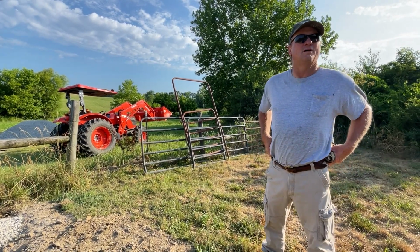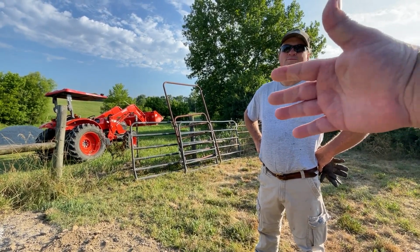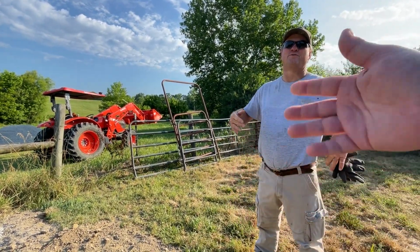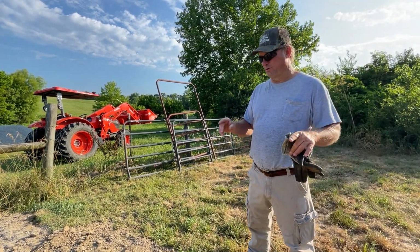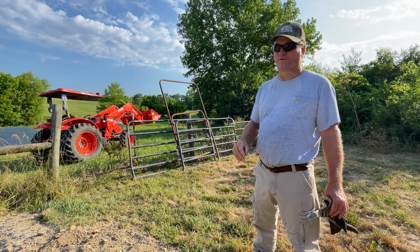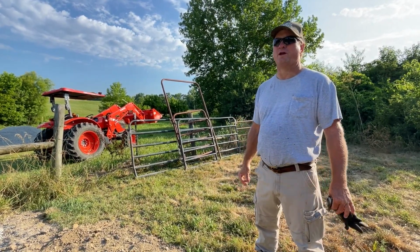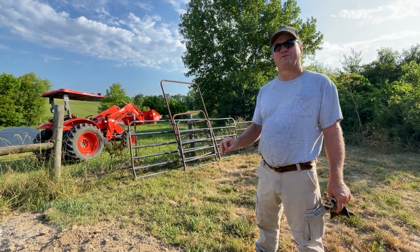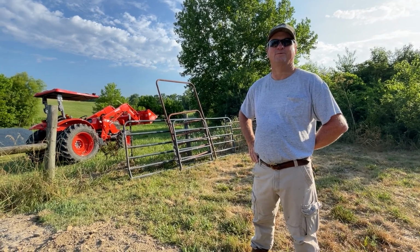Yeah, and that's your first catch on grass seed and stuff like that, because grass seed is what gets sucked in between your radiator and. But you were smart enough not to put it right on the radiator. No, it's inches in front. So you still have plenty of air. There's a little brace that goes right between the radiator and the front bumper, and the screen is in front of that brace, which keeps it off the radiator. So when you shut it off, a lot of that will fall out. Just falls down, because the suction is what keeps it up against it.